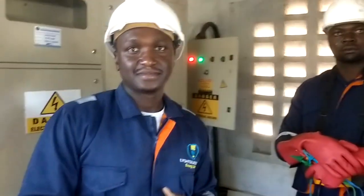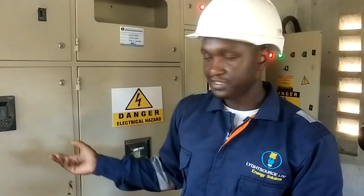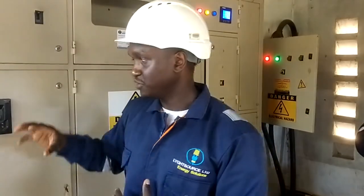Correct earthing is the general foundation of electrical safety. If your system is not earthed, any fault that occurs and you come into contact with that panel means stray current will flow through your body. Our bodies are very delicate — stray current can cause burns or even death. Beyond personal safety, failing to earth your systems means your machines will keep getting damaged: motor coils will keep burning, and electronics will keep failing. Earthing channels all stray currents from the panel or equipment to the ground.